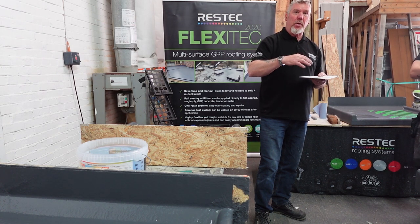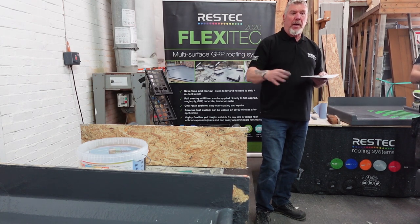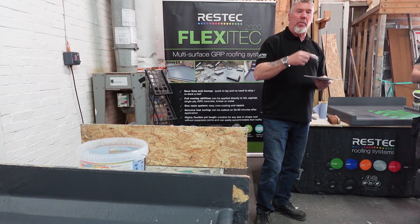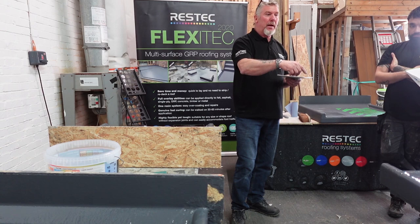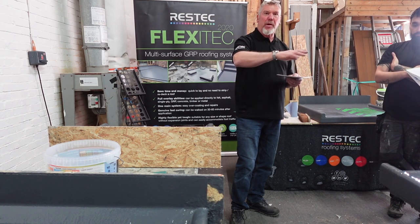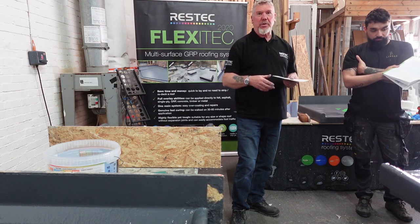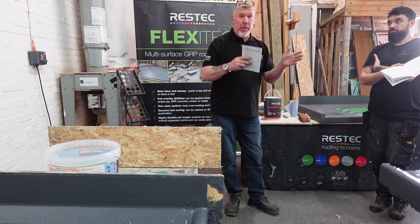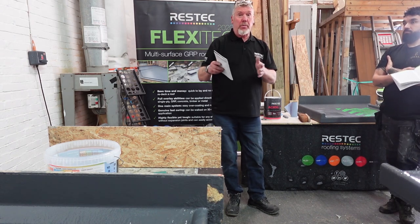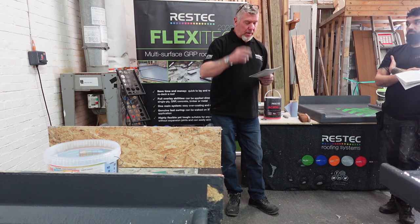Before you put your top coat on, just sand it off. Get it flat, like we did with all these rigs, and then put your top coat on. Now, if it rains on your top coat, that's a problem, because it will leave pot marks and your client won't be happy. Sand it all down and reapply within 24 hours if possible. Make sure you get that good bond. Between that base coat and your top coat, you've got about 7 days.